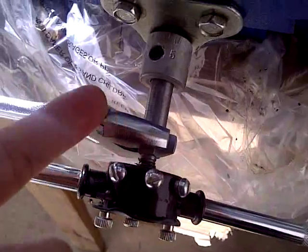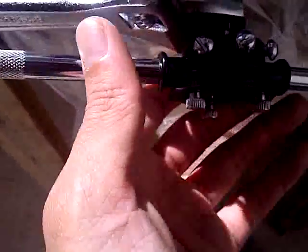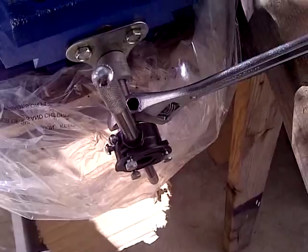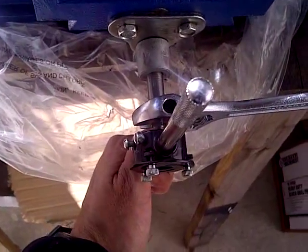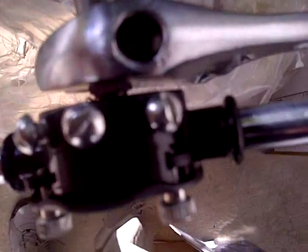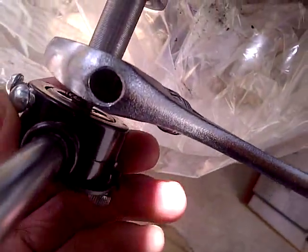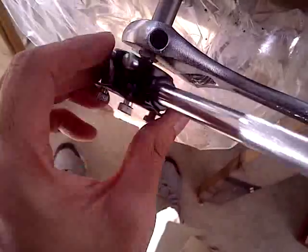Alright, here's my little setup — this thing's just going to turn and turn. I use this little vice wrench here to put pressure on while I turn this here. No, I need to go the other way with it — I need to have this on the other side. Okay, now I got it on here and hopefully this will hold. Let's slowly turn this — it's really tough. It's coming out really good. Let me see if I can get that in focus — you probably can't see that really well, but it's starting to turn really good. You can kind of see that threading. That threading looks way better — it's still kind of bad right around here, been stripped a little bit. Turns a lot easier now.